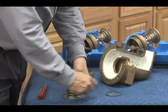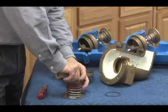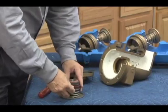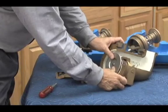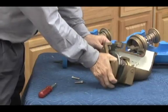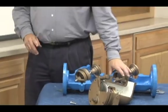Relief valve disc retainer, a relief valve retainer screw, my mounting O-ring, mounting my stem in place. Same as in the small one, cycle it back and forth, make sure it's working properly. Line up my relief valve sensing line and my relief valve cover so that my sensing line goes from the relief valve appropriately. And that's the 40-200 series, 2.5 through 10.